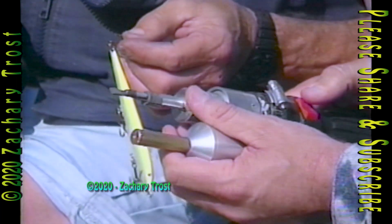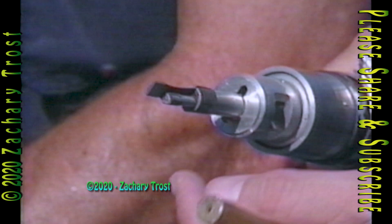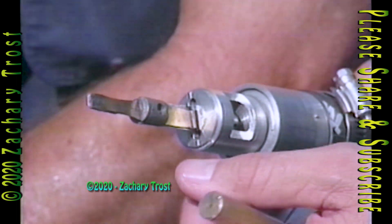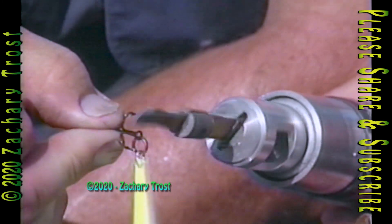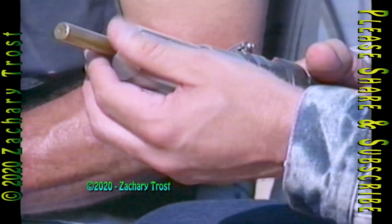Let's look at this prototype and see what happens inside this. This baby rotates around and buzzes. It's lapping the hook point back and forth 300 times a second, while it rotates around the hook point three times a second. So put the hook point there where it would be if we were sharpening this. And it goes around like that — it orbits the hook point. So now you have it sharpened.